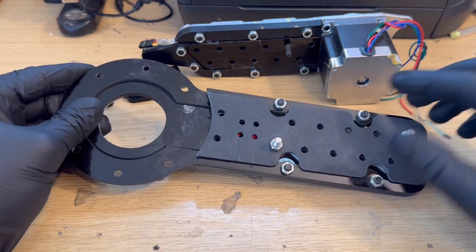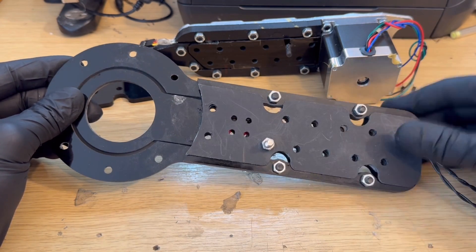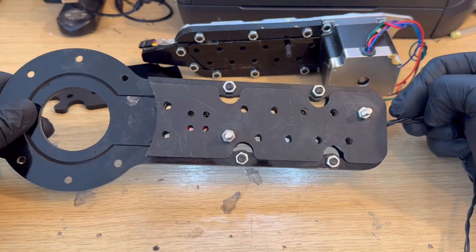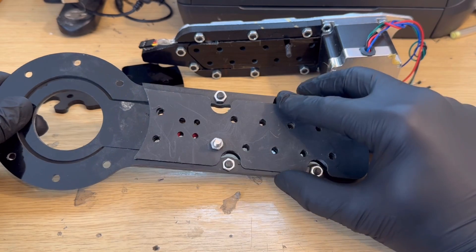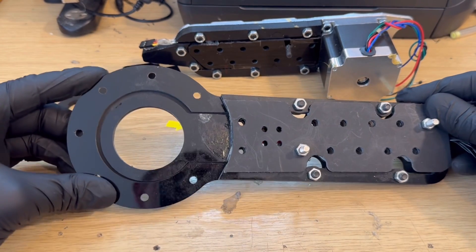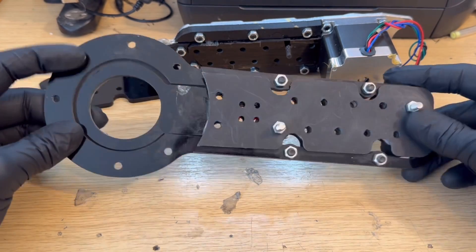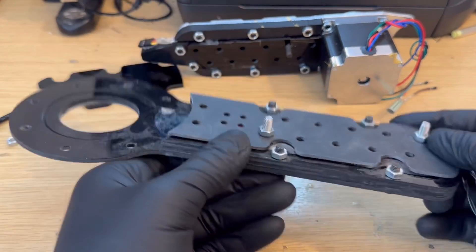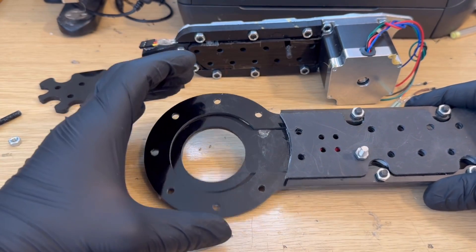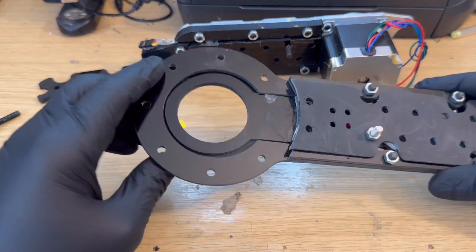This next version doesn't have FSR sensors but works in a similar manner — you can see how it goes up and down and that's how you apply force. I did try it with regular limit switches, but the problem is you don't get a proportional value and it has to move a bit too much. I did manage to slim the whole design down and make it work with a quasi direct drive robotic actuator. While this is just made out of plastic, it's all sized so it could be made from carbon fiber. However, this is still too bulky, too many parts involved. What I really want is no extra wires running out of the back — just an actuator with all components built in, with only power wires coming out of the side, making it easier to replace in the field and less likely to get damaged.